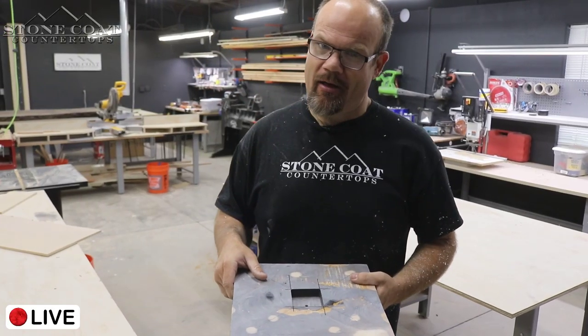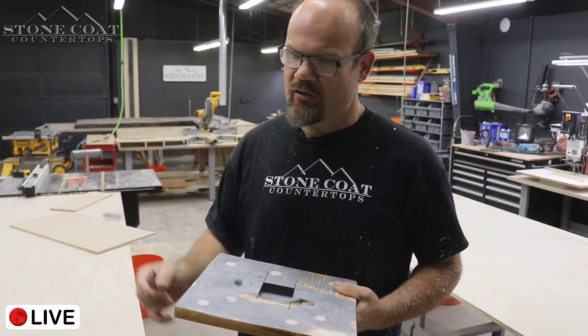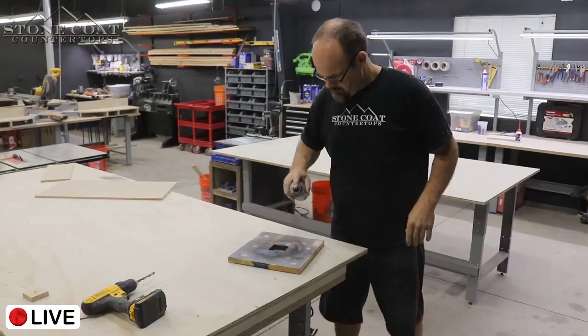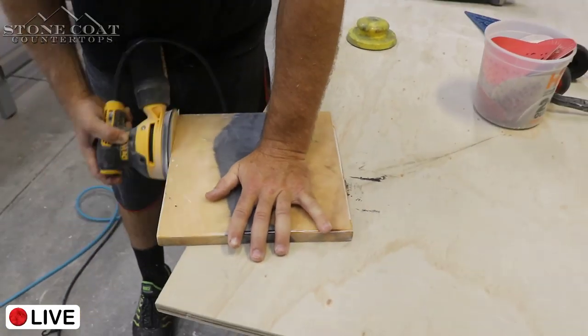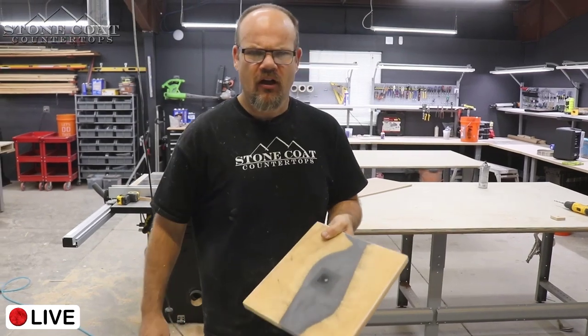Well, I learned I better make my river proud so that when I do these seal coats, it can go through, or get a longer post, right? So a longer post on your clock mechanism will actually allow you to keep that color and not go into the seal coat. If you're gonna embed a clock mechanism in the back of your project, you better go opaque color all the way to the surface, and you won't have a funky clear square that you gotta spray black.